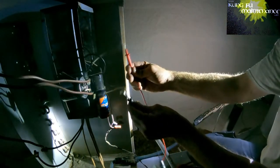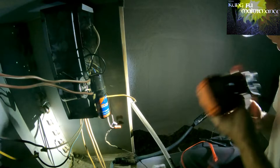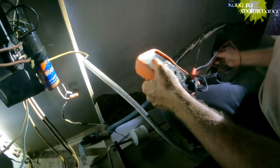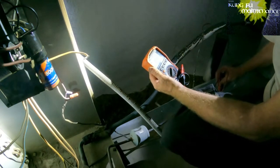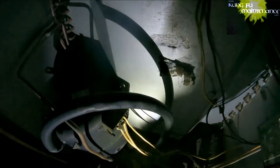See, we're still overheated. Okay, so it's just going to take me a little bit to cool that overheated compressor. It's way hot. Now back at our capacitance tests. The 35 is bad, and then the 5 is bad. Okay, here we go. Okay, get some ice on this compressor.